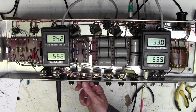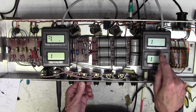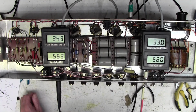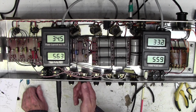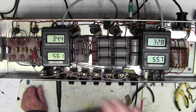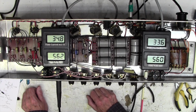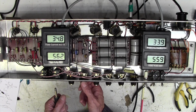So something is happening as we turn up this loudness to a certain level. For some reason this is not able to read anything. If I were to guess, I'd say this amp was oscillating. And by that I mean when we turn it up to a certain level, we get a very high frequency, huge 100-watt oscillation way beyond human hearing, which is completely trashing the power valves and making them draw huge amounts of current. Is it anything to do with having the guitar in?